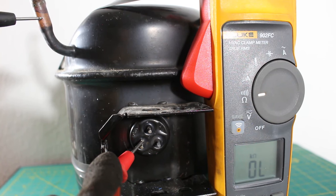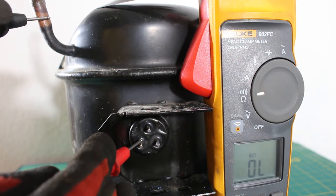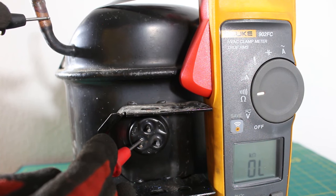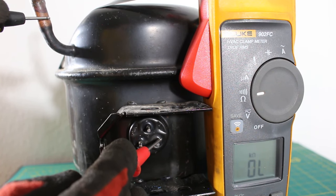You do not want an audible sound — if you did have an audible sound, you're grounded. Let's start with our start terminal. Between start and copper, which is our ground, we do not have an audible sound and we have an OL reading — that is good. Between common and ground, we have an OL reading and no audible sound — that is good. Between our last terminal and ground, we do not have an audible sound and we have an OL reading — that is good.